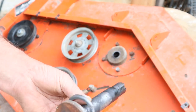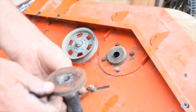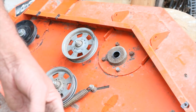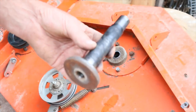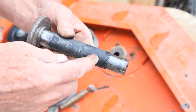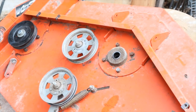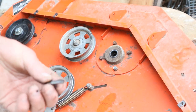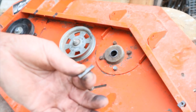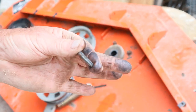This is what we're trying to get out — this is the shaft. You can see the old bearing; there's not much left to that old bearing. The bearing rides here and here, and there's a little slip collar in the middle. You boss the pulley on this section right here. This is where your blade mounts. Your pulley rides up here and you've got a keyway right here — don't lose your keyway. This is the key. Make sure that goes back in there. If not, that pulley is going to spin on that shaft when you hit something with that blade and it's going to be useless. This is very easy to misplace — keep track of it.